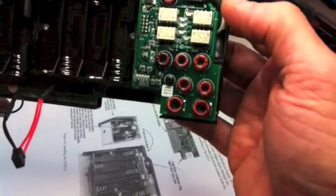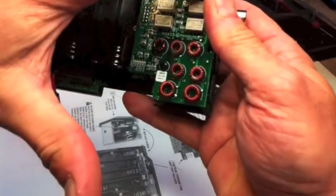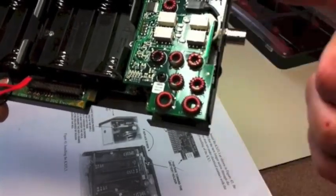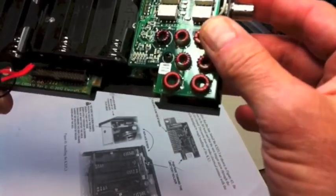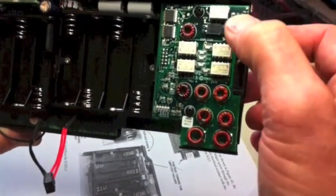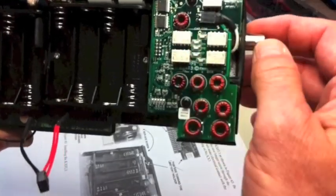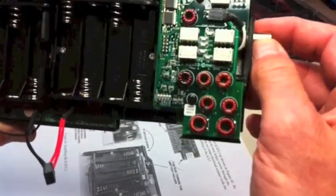The ATU installation was, to say the least, a bit tricky. You have a connector here and a connector over here that you have to line up, but the problem is you also have this antenna cable coming through a tiny little opening. Underneath the ATU there are some more relays that this cable has to go in between. You find that the two connectors mate fine, but they can't sit flush with the standoffs because the cable is underneath one of the relays. It took about 15 to 20 minutes of getting the cable routed properly so everything would sit flush — that was a bit frustrating.